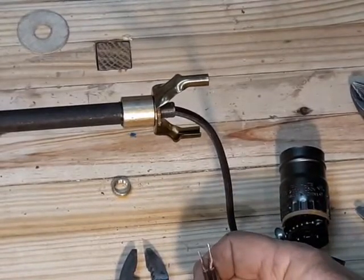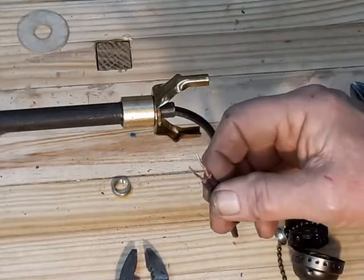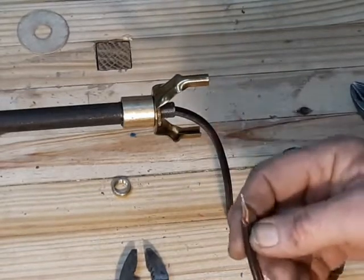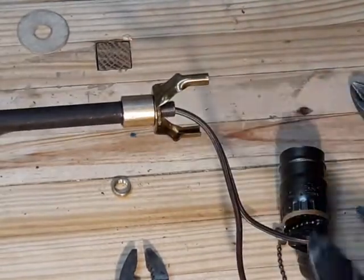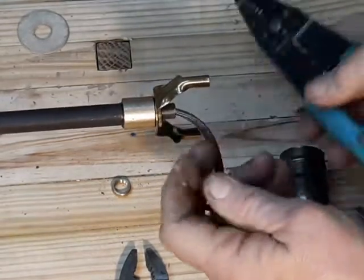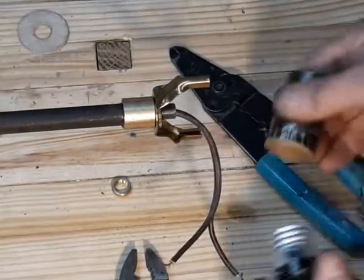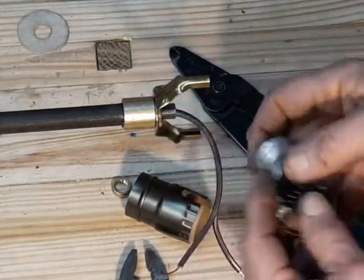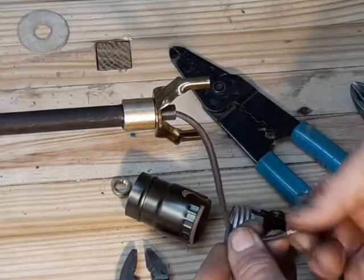We've come to a very important point on any kind of lamp rewiring. When you buy a lamp cord, the tips of the wires come with a little bit of solder on each one — that's called tinning. I had to cut this one off to pull it through the barrel, so I have to re-tin them. That's not really a choice; there is a reason for it, and it's also required by the National Electrical Code. These wires are multi-stranded, and if you put a multi-stranded wire underneath a screw terminal, instead of tightening down, the wires will just spread out and the screw will not get tight. The solution is a little drop of solder on each one before we proceed.